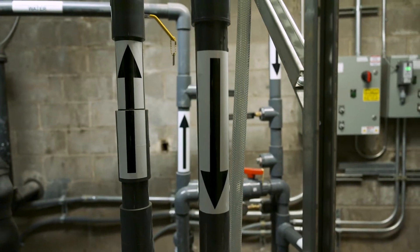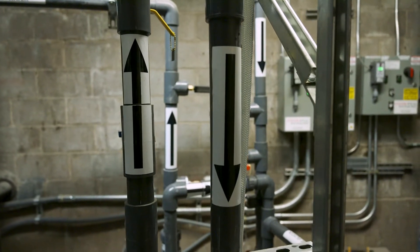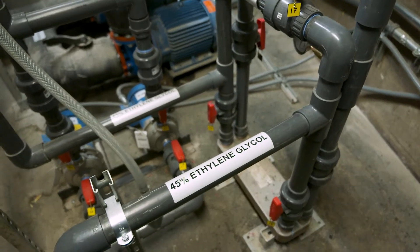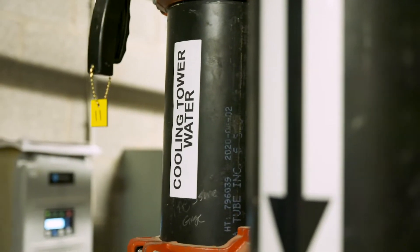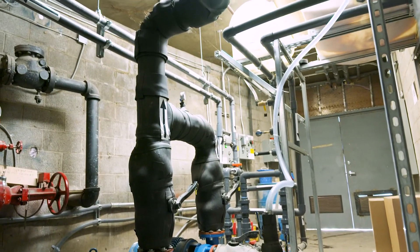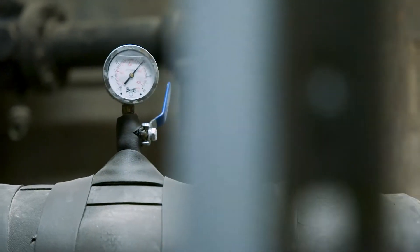We have the newest, top-of-the-line, most energy-efficient equipment because we live in a desert and it's a little harder to keep ice frozen — especially in July when it's 115 degrees outside. There are miles of tubing that pump glycol through there, which freezes the ice on top and also keeps the subfloor warm on the bottom so we don't end up with permafrost or anything that could cause damage to the ice surface or the subfloor.